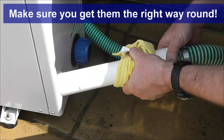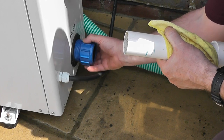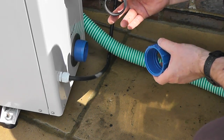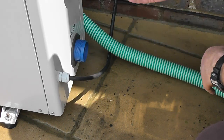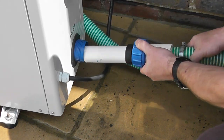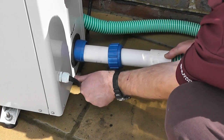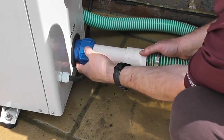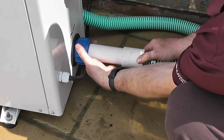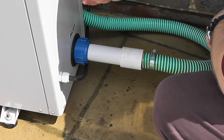The first thing to do is to make sure that everything's clean because you've got a rubber seal in there and you really don't want bits in there, otherwise you'll get leaks. Inside the joint you've got a rubber o-ring, the cap, and then the pipe goes in there. The easy way to do it is to slide the cap over the top, then the o-ring, and just push it in — there's no stop there so just make sure it's located enough, maybe three or four inches — then screw it down and you'll feel it start to bite. You can hear that it's biting, so just hand tight should be enough. That's the first piping done; we'll do the second one.